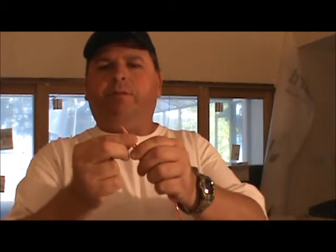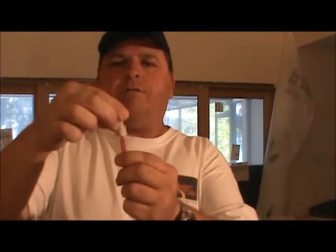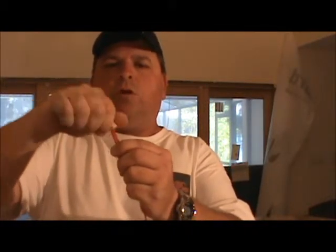So let's take a look at how to install a wire nut on a couple of 12 gauge wires. Now I've got a couple of 12 gauge wires here — I've got a red wire here. I just need to extend these wires; I'm going to connect them together so I can make a longer wire. I've stripped them back right on the end so I have my exposed copper on both wires. I'm going to go ahead and put them together, making sure that my top pieces are the same height. Then I'm going to go ahead and use a tan wire nut here.